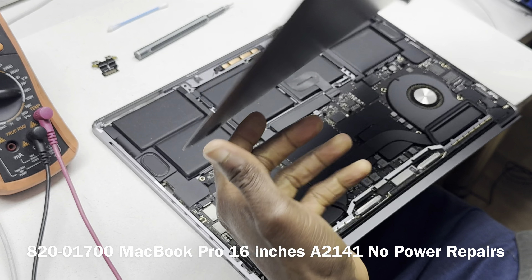The device is quite dusty. With the A2141, it follows the design of the Apple battery dual connection system. So I'm first going to remove the battery cover, and then the battery is connected to your board via two connections. The first is the battery cable.